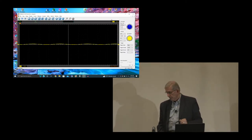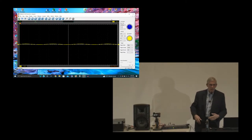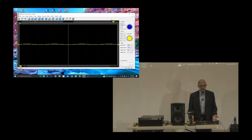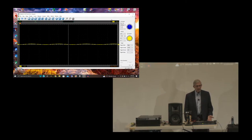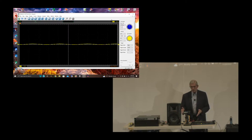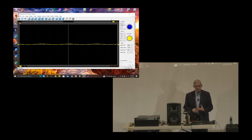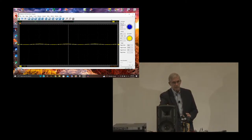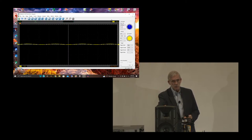That being said, amplifiers are not 80 watts or 90 watts. They're all 10,000 watts. And so it's hard to clip a 10,000 watt amplifier. There's not very many speakers that can take that, for one thing. And so we're going to talk about headroom here in a minute, but passive speakers are kind of, I see, making a comeback because you're not able to clip the amplifiers to run them up to full power anymore. And so there's really no reason not to do them passive, at least not this reason. Jake's reason, yeah, there is a reason to do it that way, but for standard biamping, you don't get any of the harmonic distortion out of the modern amplifiers.